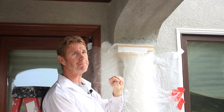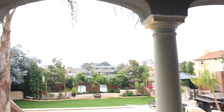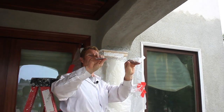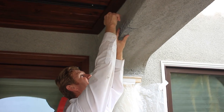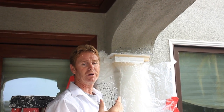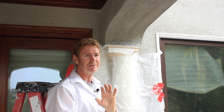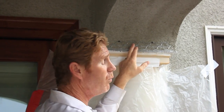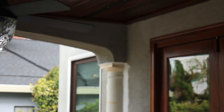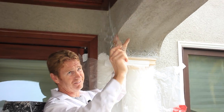There's two of them that are out of plumb. We did all the wire work around all these arches. I'll show you something with this arch aid we have here — it's called arch aid, and if done right you bend it around. The idea is you put arch aid on an arch, pull it out seven-eighths of an inch on a flat and half inch here. You've got room for error of about an eighth of an inch even if done sloppy. The fellas who did this carpentry work are amazing and terrific, but when they put this together it's off one inch — and then we have the following over there off one inch too. That's nothing, but in order to fix this properly you have to be a miter expert and really good with arithmetic to figure all this out.